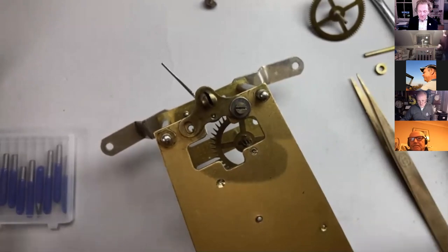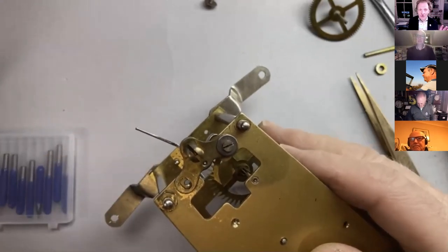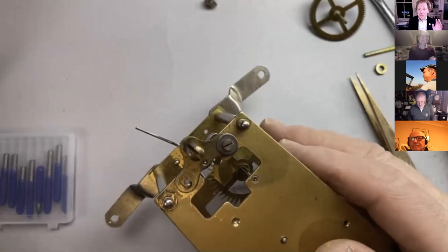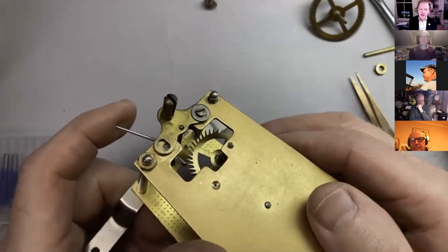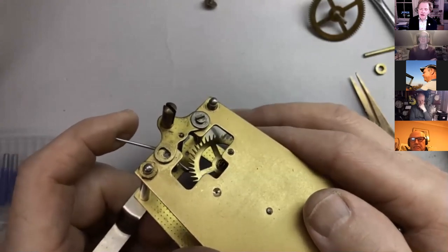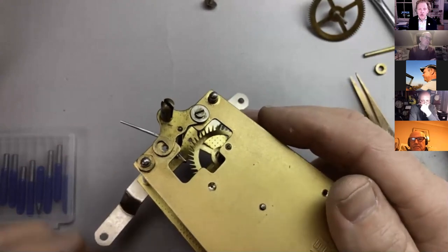So very quickly, we put our escapement together, having broken the pivot off, and it's in one of three states. Locked, where the center distance is too small. The escape wheel is free running, where the center distance is massively too big. Or like this. Let's just get it so you can see. It's better on the little model, but where there's very little engagement of the pallets and lots and lots of drop, which we know is bad because broadly we're going to lose energy.